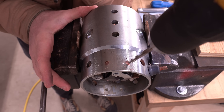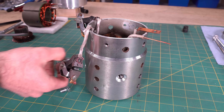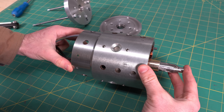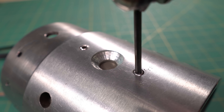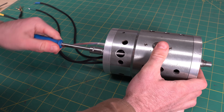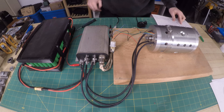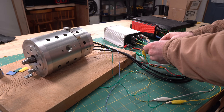The final step was to remove the windings, pole shoes, and brushes from the starter motor, as we definitely won't be needing those. Because the motor casing is 7.5mm thick steel, I decided to use set screws to hold the stator in place. This worked perfectly and also allows me to remove the stator if needed. With brushless DC motors, there are 36 different wiring possibilities for the hall sensor and phase wires. I began testing each of the wiring combinations until I found one that worked.